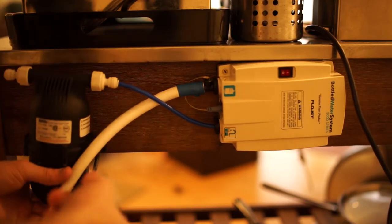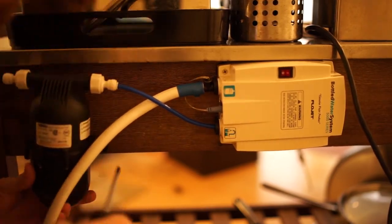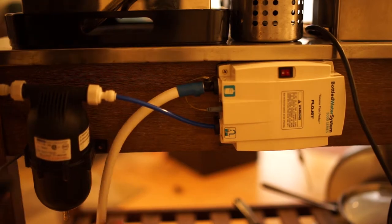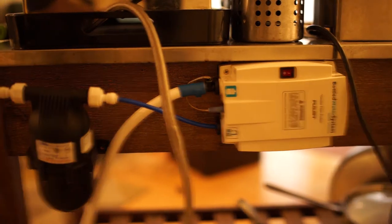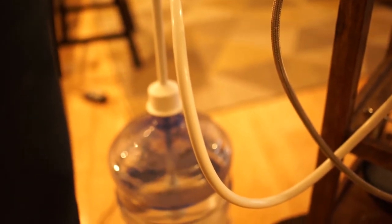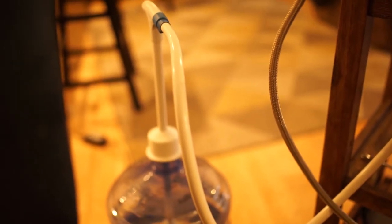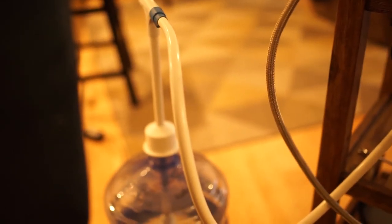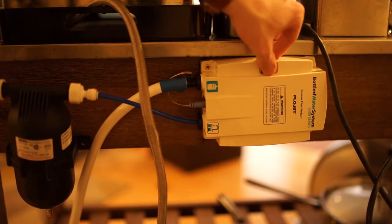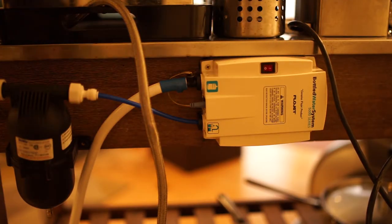All right. Now, I should have been using a washer here. Since I filmed this, I have replaced this accumulator tank. What I'm using, you can see it's just laying out there. That really should be using a washer. This was kind of shoddy work. Make sure you do that. And on the other end, I have this connector that goes into this 3/8-inch pipe for my espresso machine. That's a pretty standard fitting. You can get converters that go from 3/8-inch pipe to these 1/4-inch lines.